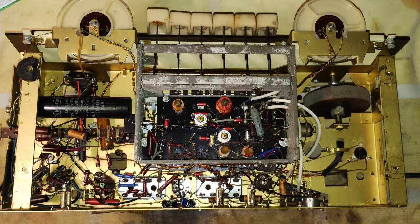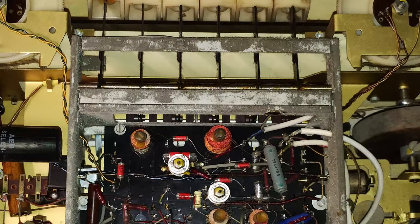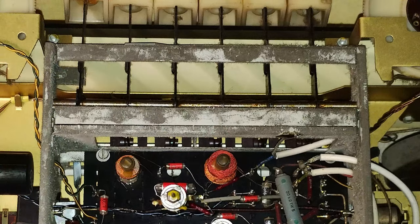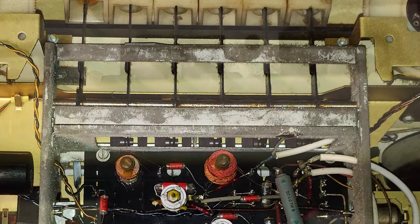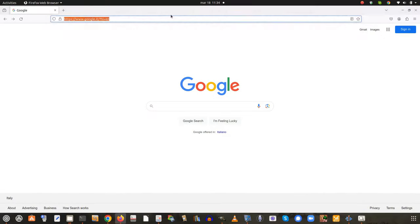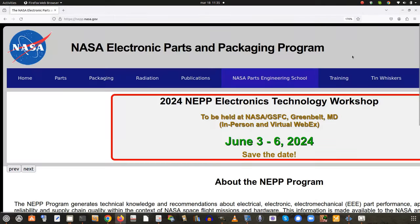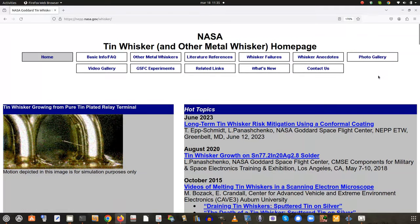Unlike the nice experience of a solderable stainless chassis underneath, there is the frame of the keyboard switch system that is made of regular galvanized iron. Unfortunately, the zinc that was covering the iron developed almost completely into metal whiskers. If interested, there is a page dedicated to the subject in the NASA Electronic Parts and Packaging Program site, with links to many related documents.